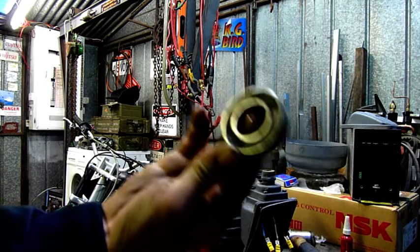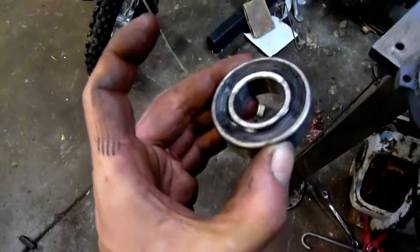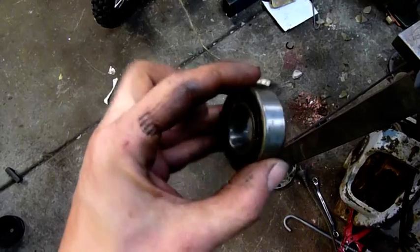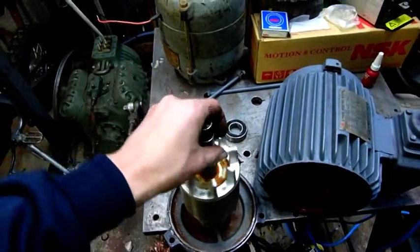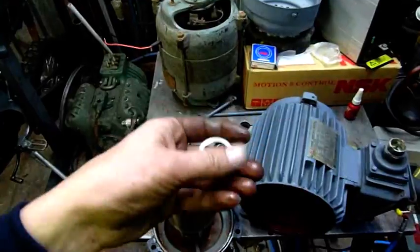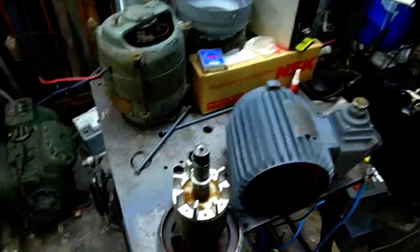That's the old one — what's left of it. Don't trust your old stock bearings, especially if they look like they've been sitting around since the 1970s. It was inside cardboard but not plastic wrap, and it ran pretty smooth — but it ain't smooth now. Doesn't feel rocky until you load it up or get it spinning real fast. So just buy new ones. Buy NSK or NTN bearings — don't buy cheap Chinese ones, they always flog out after a couple of months. Never ever use counterfeit bearings on wheel axles or trailers — if they seize up and shatter you're in real big trouble. Counterfeit bearings are a major problem and often lives depend on it, so buy good quality bearings.